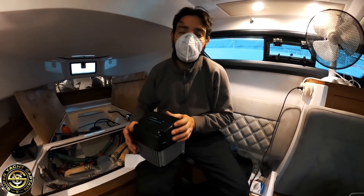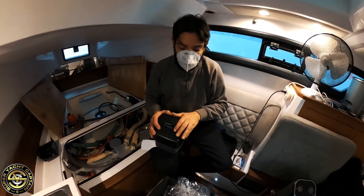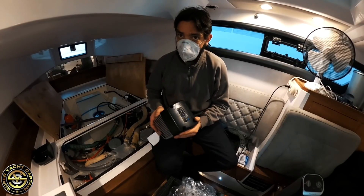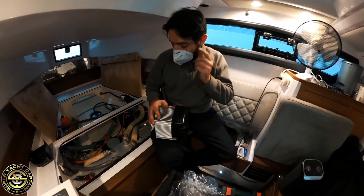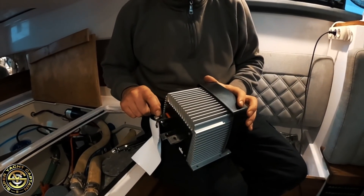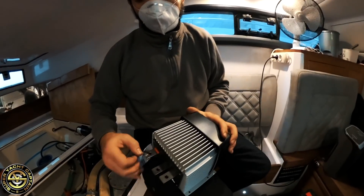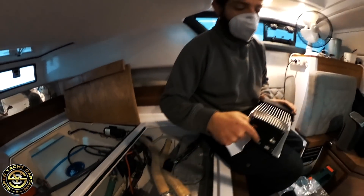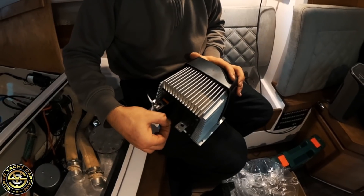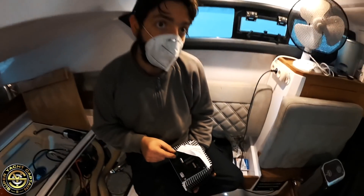This is the Power Proportional Control - the PPC. For this type of thruster it's a PPC 520. For a bigger thruster it would be a PPC 800. This one is not too big, which is good because space is limited. We need to install it near the cable - from there the positive arrives and goes via the bridge to the motor, and the negative arrives on the other side to the motor. This is the proportional control. We also have the S-link cable for communication - we need to run all the lines for the S-link cable.